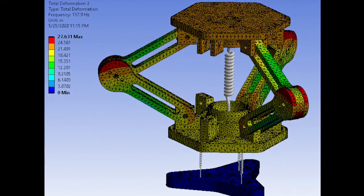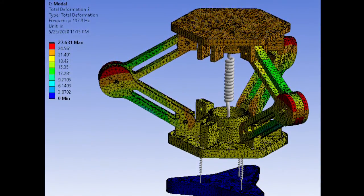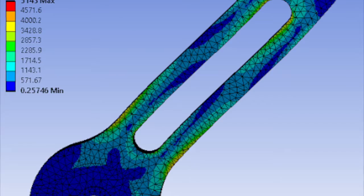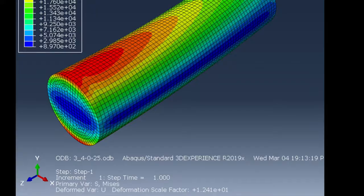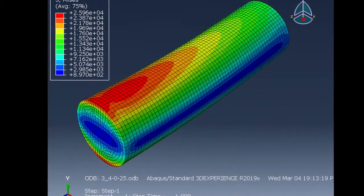The 2 main loading cases we were concerned with were the 20G quasi-static load applied at the off axes and the launch load at maximum transmissibility. By breaking the system down into smaller components, FEA was a lot more manageable and provided quick turnarounds for certain parts that would be more prone to failure. Without FEA, we would not have been able to verify our MATLAB or Simscape models.